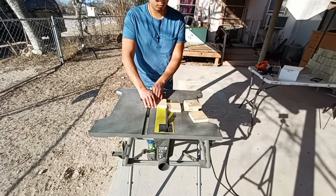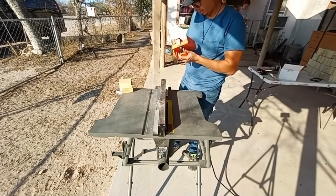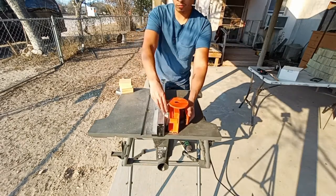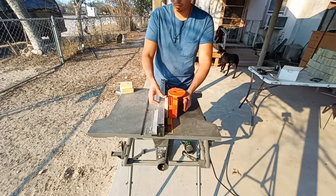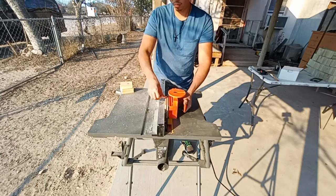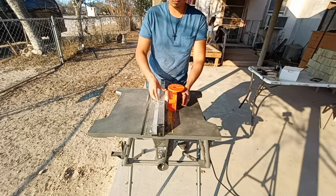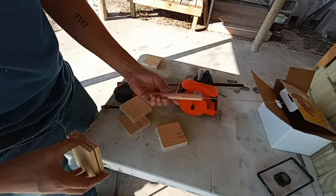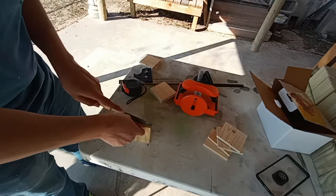We are now going to set up the saw to cut these squares right down the middle. What I found best was to set up the fence to cut down the middle of these segments and then lower the blade to just under the halfway point of the three and a half inch piece of wood. I push the wood through, cut one side, then flip the board over and cut through, leaving just a small — maybe one eighth inch — portion of wood in between the two coasters.